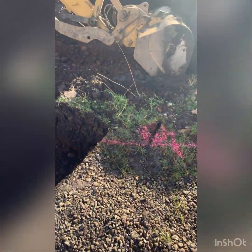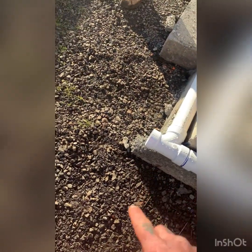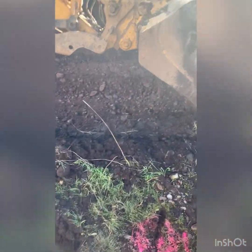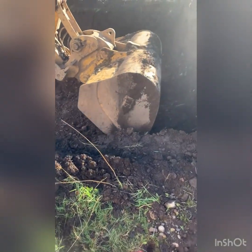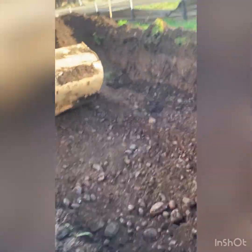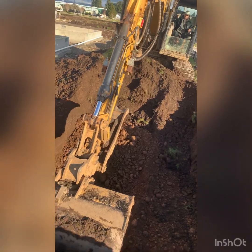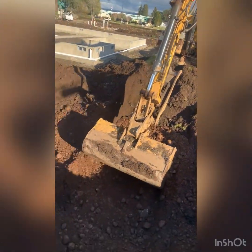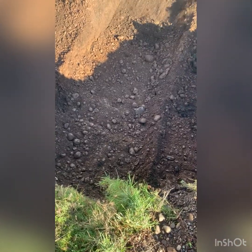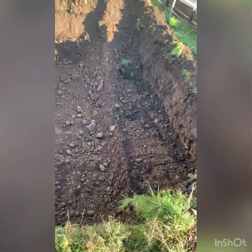So we got Robert over here digging the soakage trench. It's gotta be 3 foot below this grade here. That's gonna go to one of the little catch basins I showed you, but this, they wanna inspect a raw excavation. So he's on the 312, digging it. Yeah, that's gonna be filled with round rock. It's gonna be fabric laid down, round rocks, pipe. We'll get more to that tomorrow.